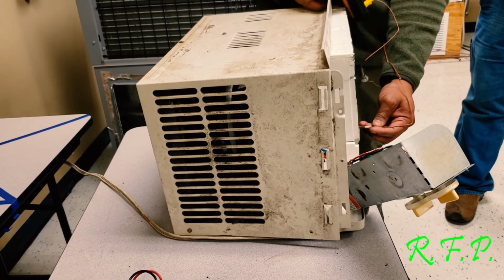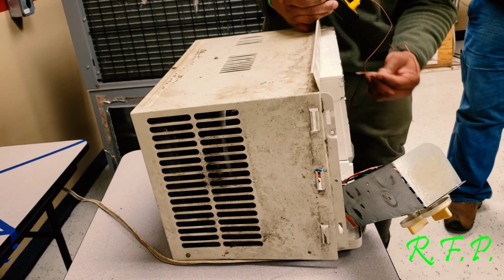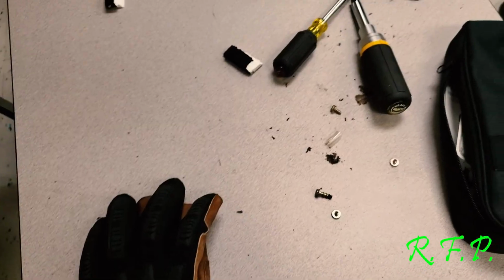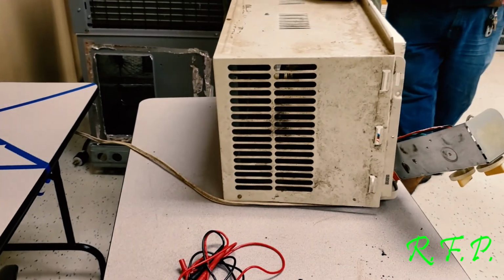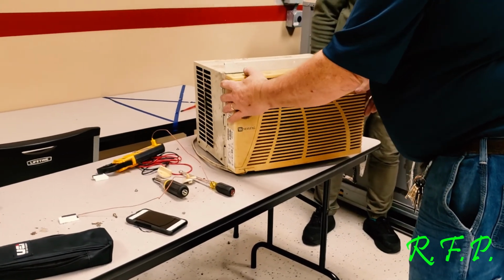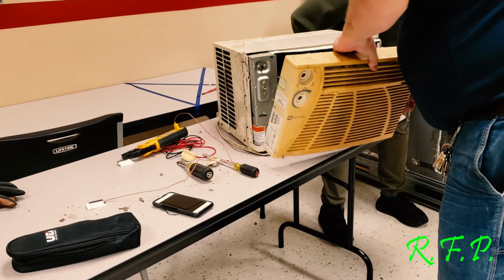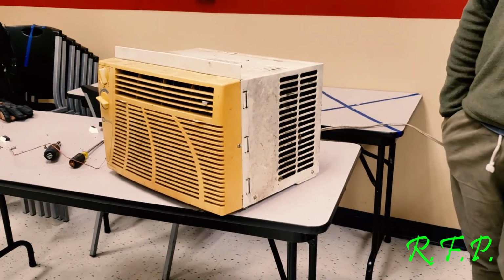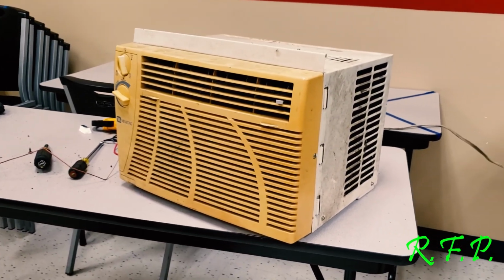Unfortunately, everybody wants to put a piercing valve on it and check the freon first, and I say keep your hands off of it. If it ain't got an access port, leave it alone till you know you need to check the freon. That's not changing about 5 degrees right there. This could be a little freon or it could just make it run a while. Is that because the high side, we have to equalize it? Okay. It's still under pressure.